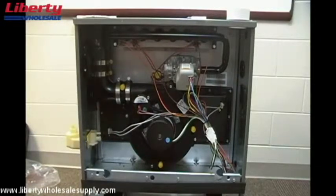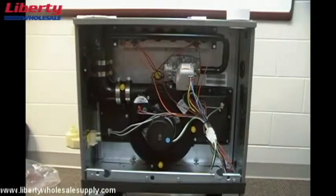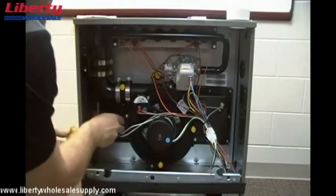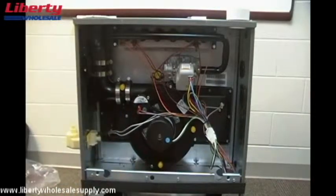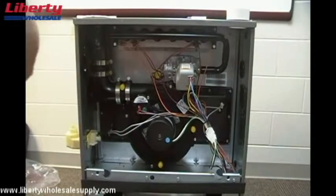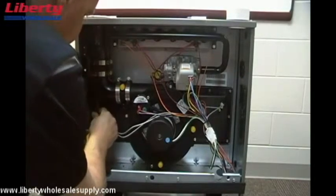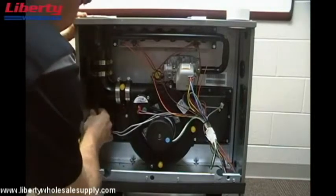We have a quarter-inch hose that comes with the RHGY-CK kit — you usually have about 15 to 18 inches of this in each kit. You need to pre-cut it to about four inches; I've already done that for this exercise. I'm going to install this quarter-inch piece from the top of the condensate trap to the collector box. Next, I'll take pre-cut hose D to line two and install that on the elbow. You might need to use a little soapy water — it helps the connection go on better.